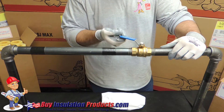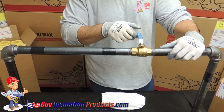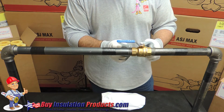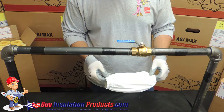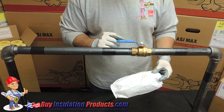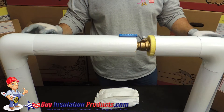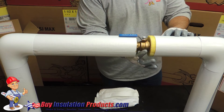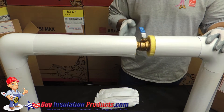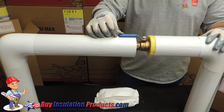The valve handle has to be left exposed so you can easily shut off the valve if needed. We're going to insulate the pipe all the way up to the fitting, then cover the valve with a reusable valve wrap cover to allow access to the handle. We insulated the entire line, leaving the ball valve free — we need to allow that valve to be closed in case of emergencies or regular maintenance on the line.